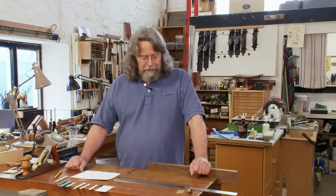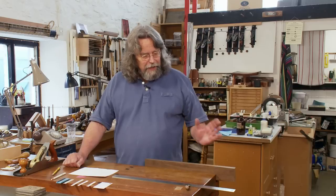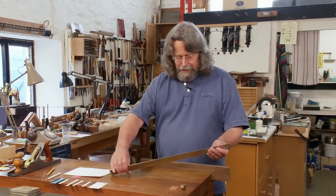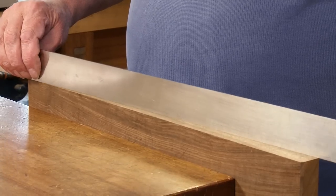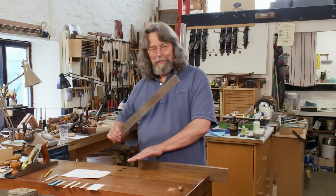The first thing I'd like to show you is what I call the edge exercise. You've already seen me taking a number of shavings off this edge and the question is, is it flat? Now I've got a precision straight edge here — Starrett — and we can see immediately that it's pivoting about the centre, indicating that this is actually a bump.